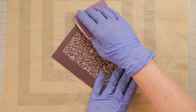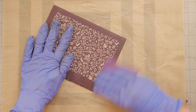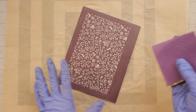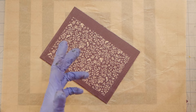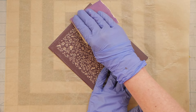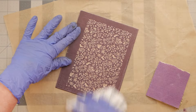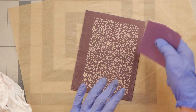The last set of steps is another sanding. You want to make sure that at least most of the ridges from the brush strokes are sanded down. If the varnish is not completely dry, you will be sanding along and pull up some gummy pieces — you do not want that. It's hard to fix; basically starting over is usually what happens. I like to wipe away the dust between passes so you don't get little bits caught underneath the sandpaper and gouging into the varnish.